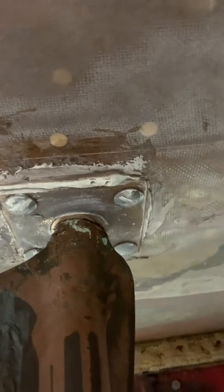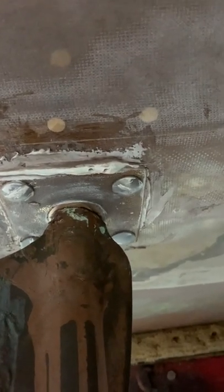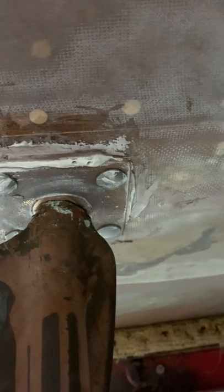All of that is now sandwiched together between the four-bolt flange on the rudder port on the inside and the four-bolt flange on the bottom side, jammed together with a piece of three-quarter-inch BS-1088 marine ply that goes from the transom to the next frame. All the rot has been surgically removed and treated with clear penetrating epoxy sealer and a borax solution, which kills fungus.